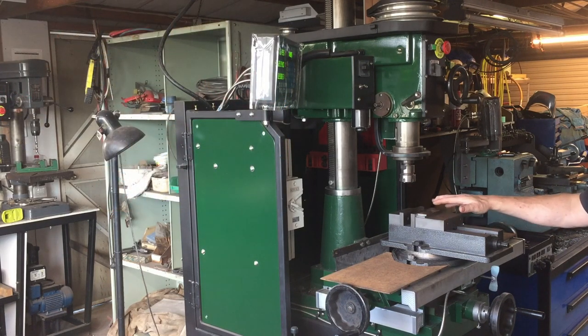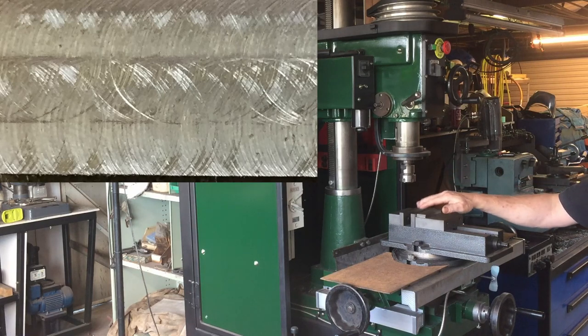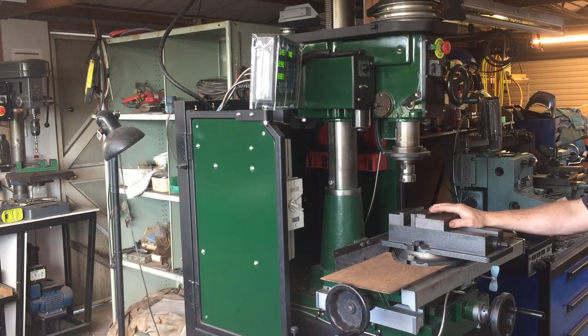When you're using a cutter and the head is not perpendicular to the base, the cutter going across will have the back of it skimming the surface you've already cut - or worse, cutting a lot deeper than just skimming. I know the head is tilted - looking at it, the top leans to the right a little bit. I need to work out which way it tilts back and forth as well. This video is about figuring that out and correcting it by adding shims where the column bolts onto the base.